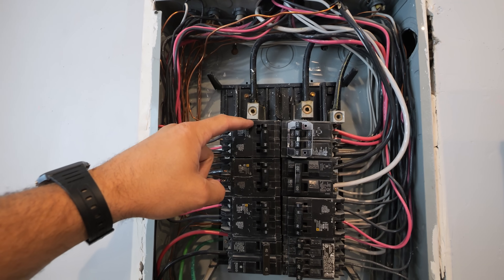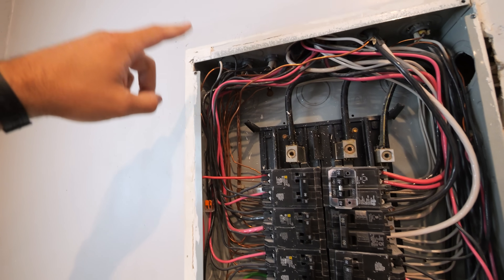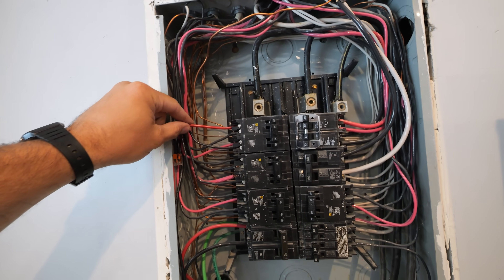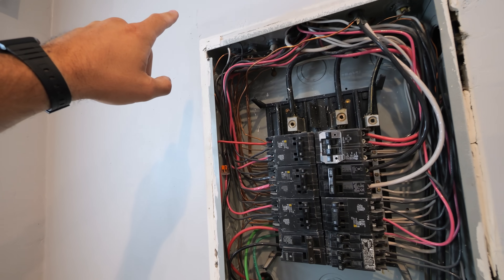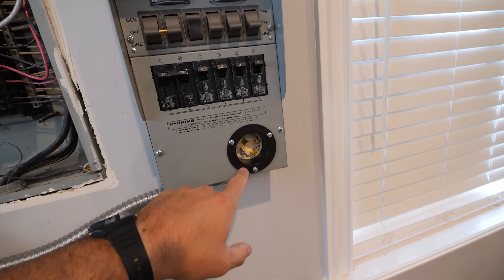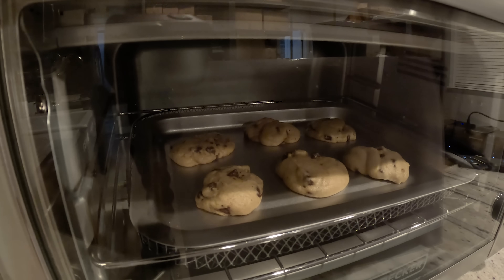Take for example this first circuit, which goes to my office computer — probably the most important thing in here. Normally power would come in through the grid, hit the breaker, and go off to my computer. However, now that we have the battery backup, power comes in through the grid, goes into the red wire which comes over here to the transfer panel switch, and since it's on grid power it comes back out through the black wire and then off to my computer. If we switch it to generator mode, then it would take battery power instead, passing it out to my computer. And I can still bake all the cookies I want during an outage or an apocalypse with my countertop mounted unit.